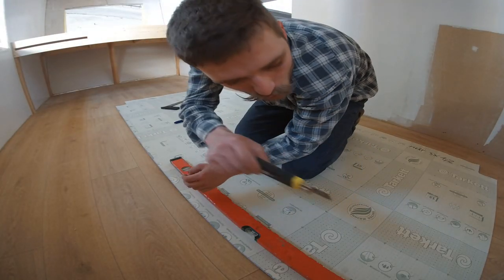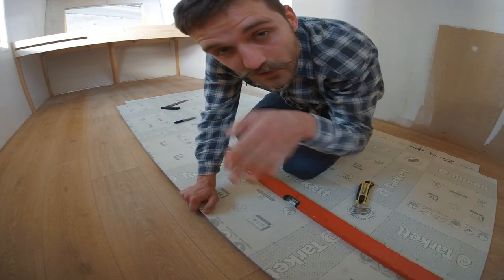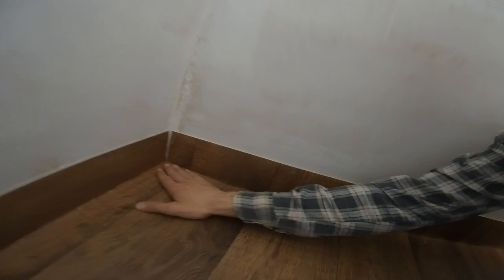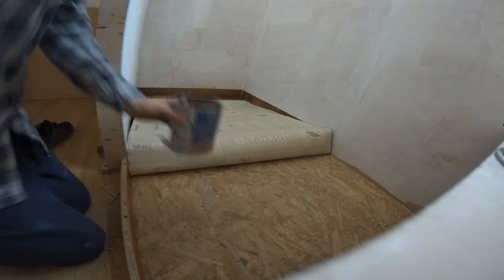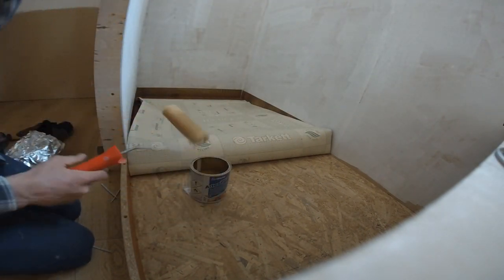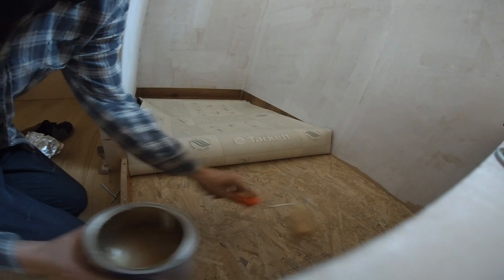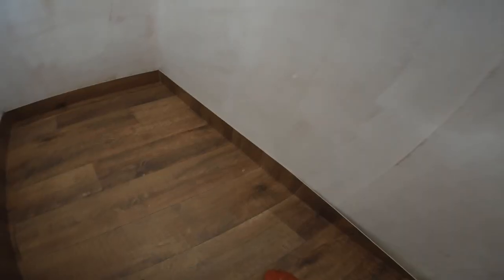Now very carefully I'll score the back of the vinyl with a knife so that I can fold it over and the edge will be perfectly 90 degrees. After some cutting and adjusting, I managed to get everything absolutely perfectly in place. Now I can glue the floor in — I folded it back half, just like the other time, and I'm spreading the glue out to cover the floor and the vinyl. The floor is being glued in and I just need to cut around the drain and trim the edges, and then I will be done with that.